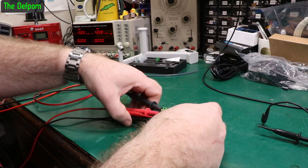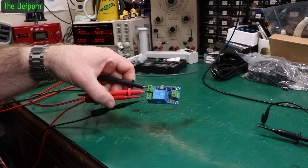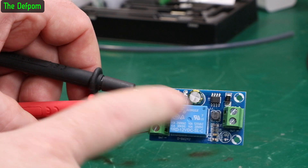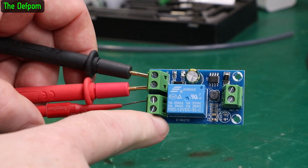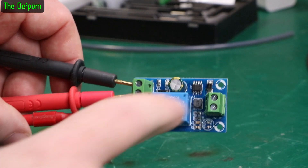Just a quick little video. I'm just playing with one of these little changeover boards. This is a 12 to 24 volt changeover board. The idea is you have a battery supply coming in here and some other main supply — it's like a little switchover thing. So if you lose your main supply, it will drop over to the battery. It's like a little backup system, a redundancy kind of thing.